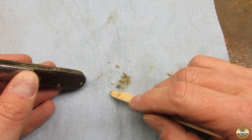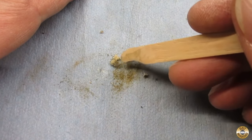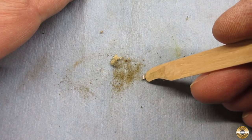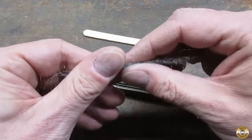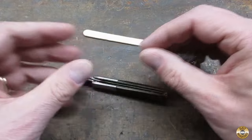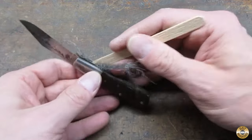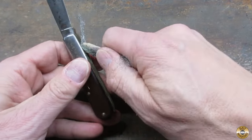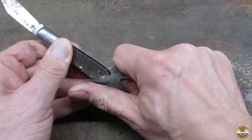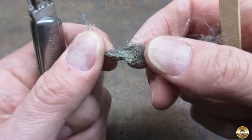I don't know what that is — a little piece of metal. No bugs this time, just your normal pocket lint and what looks like the remnants of a chewing gum wrapper. Got some steel wool here, twist it up, use the same popsicle stick to push the steel wool into the blade groove and run it through. Look at all that gunk it's cleaned out.